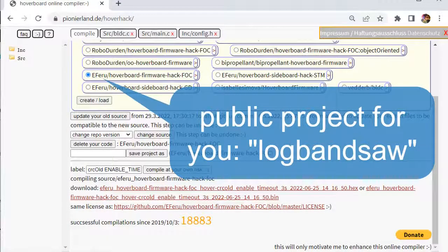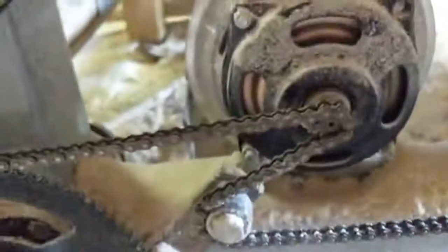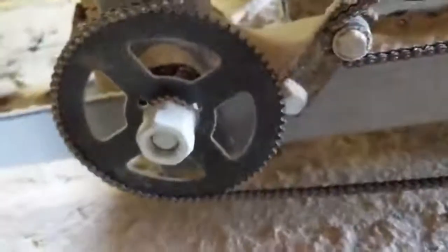You can simply push the machine manually. That's the old approach here with this clutch — it was quite nice. Sometimes it gets too hard and the clutch skips, giving way so as not to overload the motor — it acts as a mechanical safety.